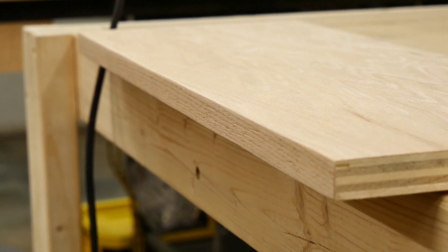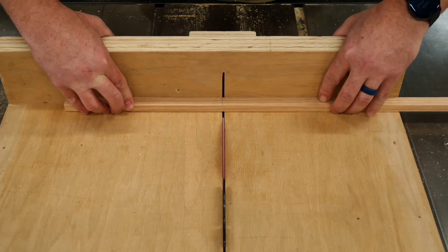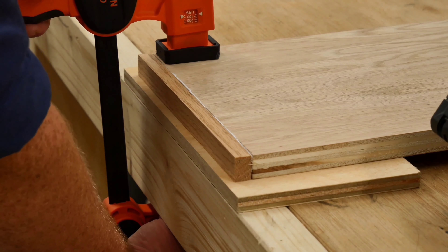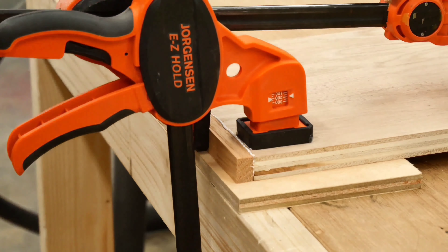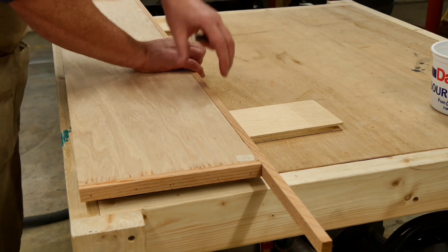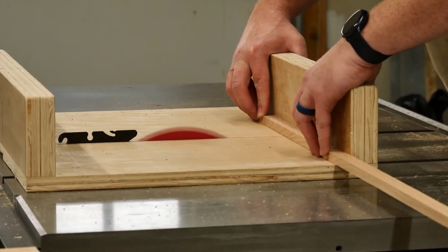After those were all done, I set them aside and started on the topper. This piece will mainly consist of plywood with solid oak strips added to the edges. I cut the strips down, added some glue, carefully clamped everything so it was a nice tight fit, and then drove in some brad nails to secure it. I repeated the same thing on the other side, and then before attaching the front piece, I held it up into place so I could get a correct measurement and cut it down to size. Overall, this is a pretty effective way to make the top board look like a solid piece, but it's not exactly the most elegant solution. By securing the strips with brad nails, you're left with nail holes, and even though you can apply some wood filler to mostly hide those, they're still somewhat noticeable. Regardless, this is the way I chose to do it for this particular project, though I may look into alternative methods for future projects.